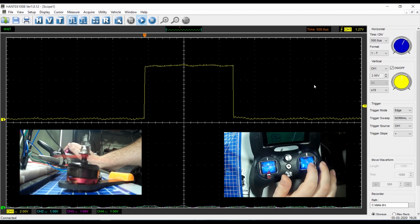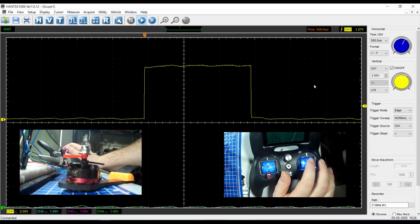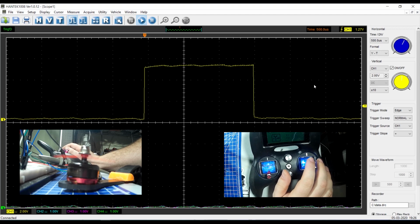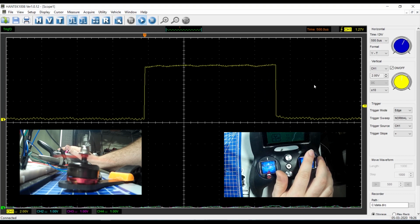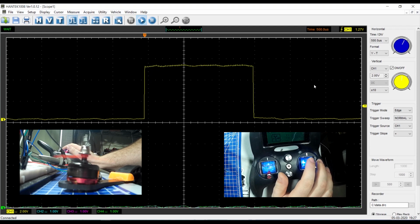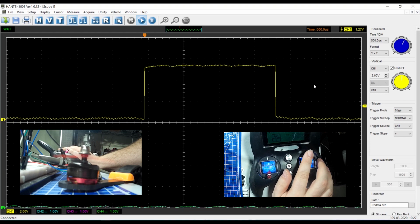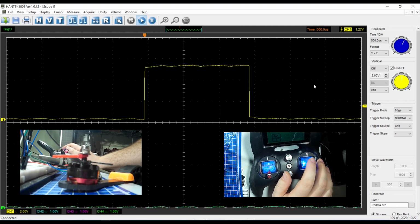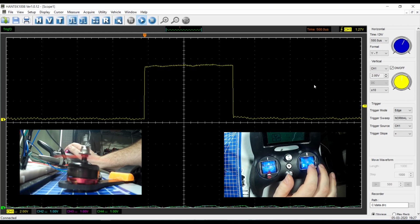So what we have here, we're looking at the actual effect of the code, and as you can see, pulse width modulation is not a misnomer. You can see that the pulse's width is literally being modulated to determine the value that's being sent as I change the value on the stick, and then the motor speed changes proportionally. Yes, I know my oscilloscope's not the greatest, and it's not a very stable signal. I don't know if the flutter is the signal from the Arduino itself, or if it's my oscilloscope interpreting it kind of weird. But sometimes whatever tool you can afford is the best you have.